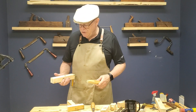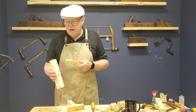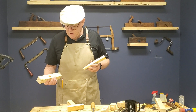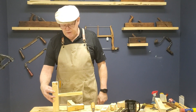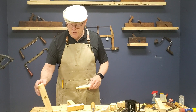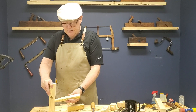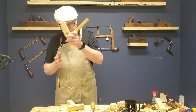The most common application is in chairs, stools and things like that. In this case, I have got my square stock and this is simulating a chair leg, possibly. This could be a stretcher and we can do a straight 90 degree. If your chair leg is running vertically, that will give you a horizontal fit. Or, if you are putting a little angle on the chairs, you can drill the holes in like this and get a horizontal stretcher but an angled leg. I think this is probably the most common.